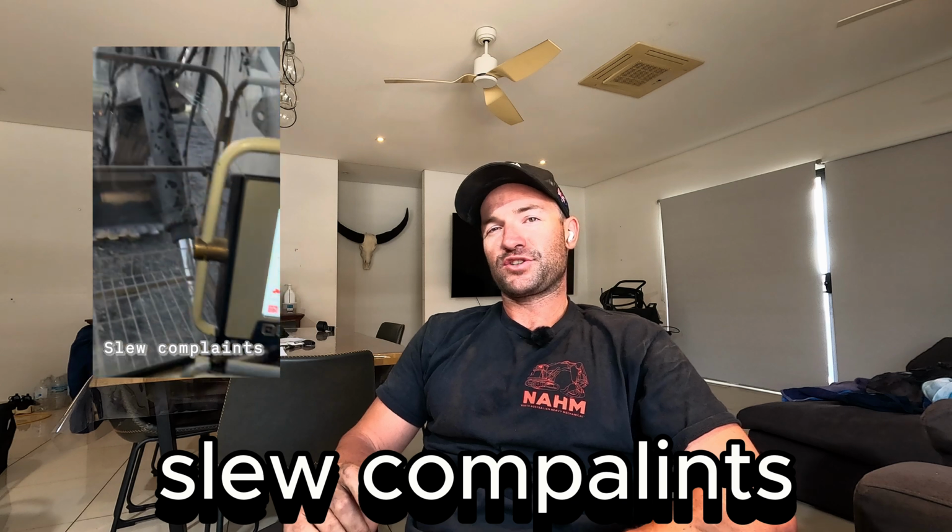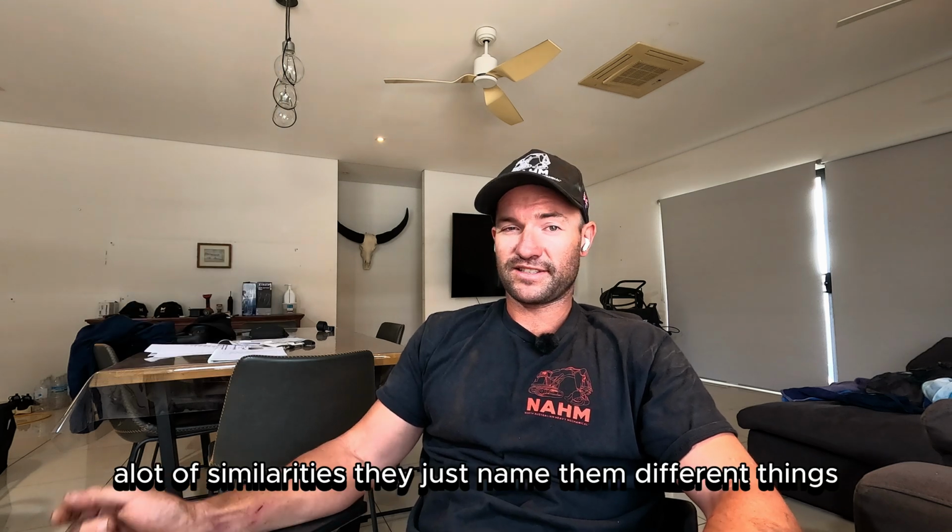Today I'm going to run through one of the reels that I did and give you a bit of information on closed loop hydraulic circuits. My experience is Liebherrs and ONKs. They're very much the same system, they just like to name things a little bit different. To start off with, I'm going to give you a bit of an explanation on how the pumps work. They are a piston pump, they work slightly different to the standard conventional piston pump.